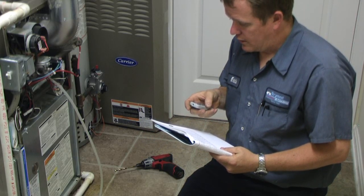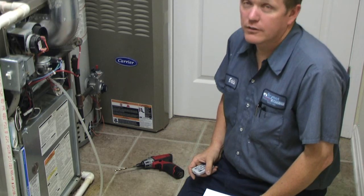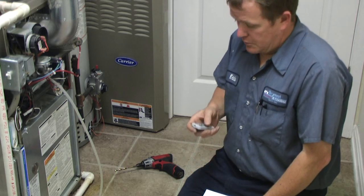This is one method — it's not terribly accurate, but it'll get you in the ballpark. The second way is to actually measure inside the ductwork what the CFM is — you need an anemometer for that.